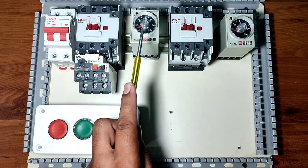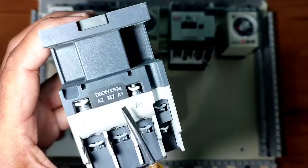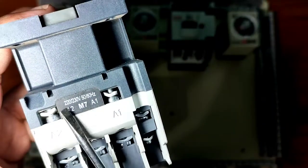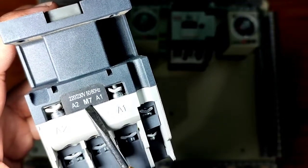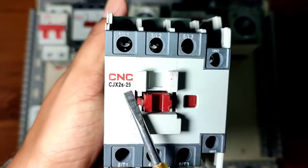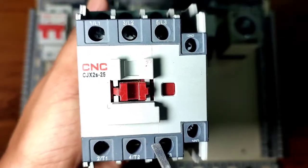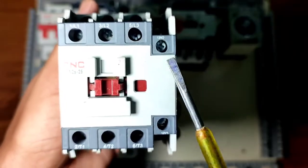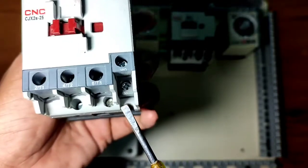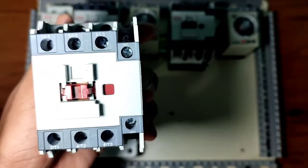Before starting the control wiring, let's first cover the basic concept of the timer and contactor. This is the contactor you can see here. To operate this contactor, we need to provide phase and neutral supply to the contactor coil, which is 220 volt AC. This is the contactor power terminal where the motor terminal is connected, and we have some auxiliary points including NO point 13 and 14 and one NC point.